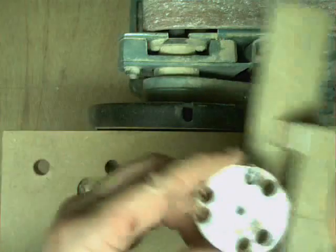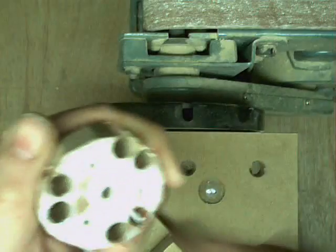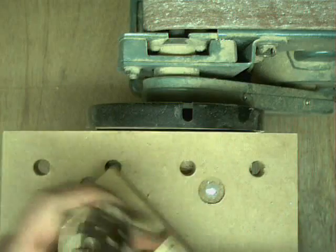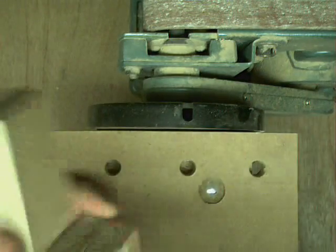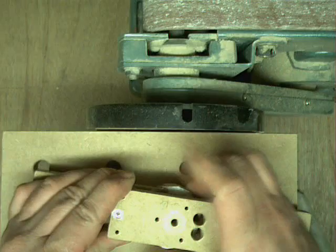If you find these binding a little too much for you, get a candle. You will need to sand this off after, of course, because we need to glue them together. But just like as so. You can do the same in there if you want, if you can get your candle in - I can't. And you'll find that they'll turn much easier.